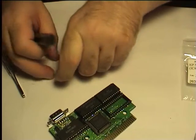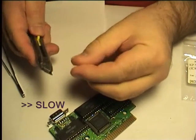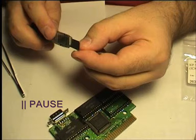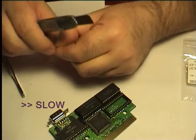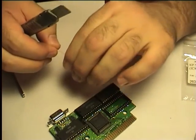Take the wire into your hand, put its end onto your forefinger and put a sharp blade into the location of the supposed wire cut. Do not press the blade towards your finger or you will cut the core and then your finger. Slowly axially rotate the wire under the knife. Remove the insulation, cut at the end of the wire, and use a twisting motion of your fingers to twist its multi-core around the axis.